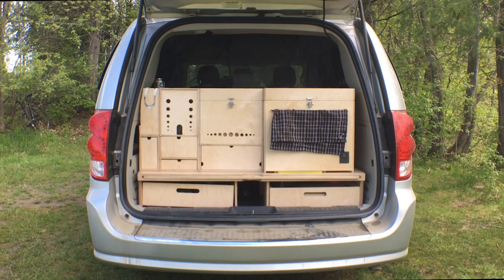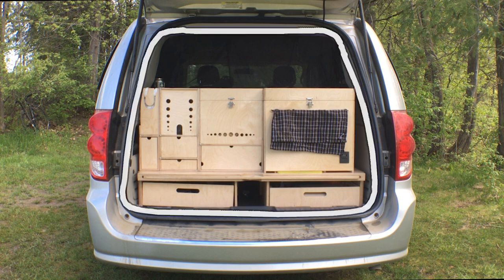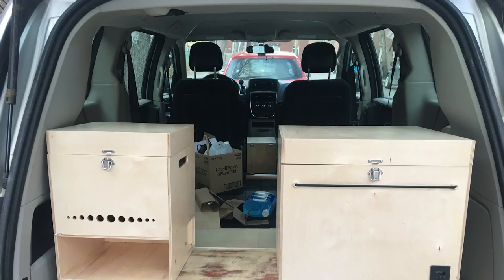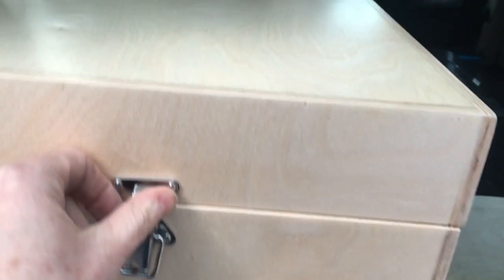The reason for these changes is simply that I messed up when planning the kitchen. I put the blame on trying to build a kitchen for a small, awkwardly shaped space and trying to keep a lot of different things in mind while working, and a few of those things got forgotten. But in the end, the truth is that I made a mistake and the kitchen didn't fit in the van. One factor is the shape of the opening in the back, which narrows towards the top, which I didn't keep in mind when planning the boxes. I based all my careful plans on the measurement at the widest point, but that is not the same as up at the level at the top of the boxes. Another problem was that I didn't really have the option to go back and forth to the van while building, so I didn't catch my error until it was all done and I went out to install it, and the boxes didn't fit.